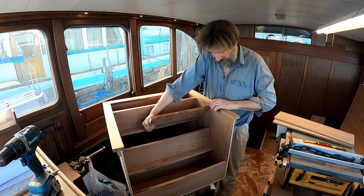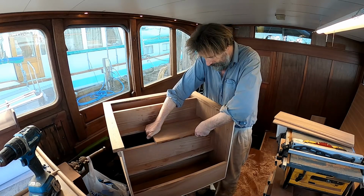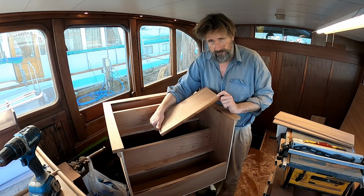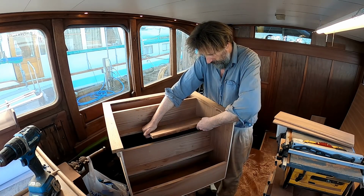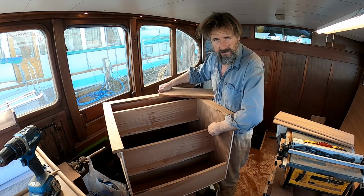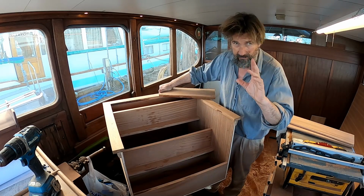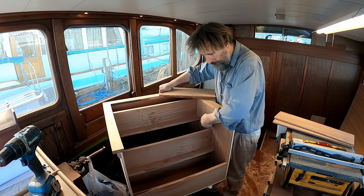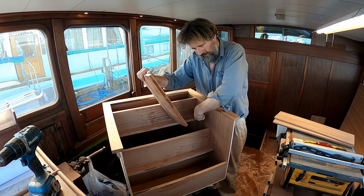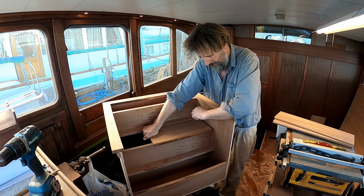Now, I knew this was going to happen. I wanted this overhang for, well, really for design. So what I had planned to do is slice off 3/8 of an inch of the end of this tread, move it over the 3/8 so when it comes up, it clears it, and the remaining 3/8 stays permanently on the carcass. Now, it's not that ugly. That sounds ugly. There's also going to be a support piece under here, which is large enough to carry both the little piece that gets glued in here and the piece that comes up when it's in its down position.